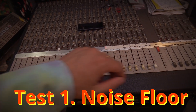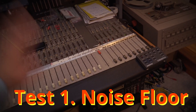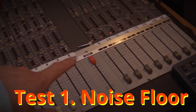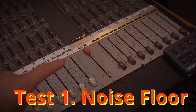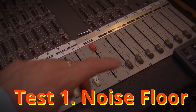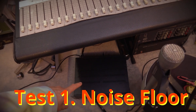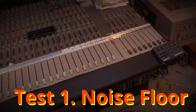For the first test, the noise floor test, I have completely zeroed out my board where every single fader — for my channels, my aux, and my groups — are completely all the way down. I don't have any other equipment connected to this board. We're strictly just looking at the main stereo channel for this board. I have it all the way up so I will have it in the same exact place when I do my post-recap test. I'm simply sending the signal to an interface and recording it on my computer, making sure the gain on the interface is exactly the same for both tests. We're strictly just doing an A to B test.